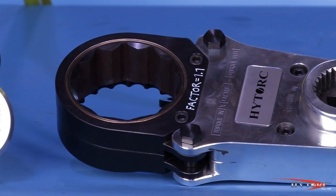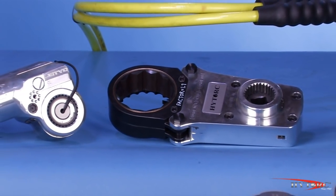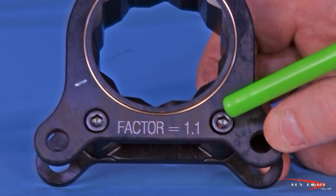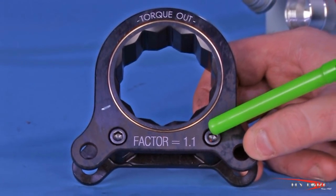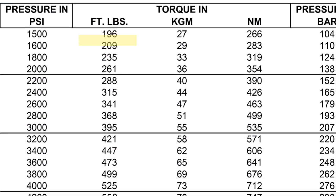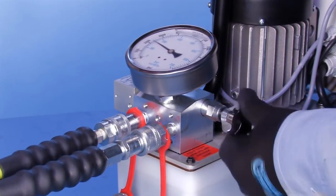Choosing an offset link with a 3/4-inch square drive receptacle and a 2-and-3/8-inch ratcheting link would be appropriate because 600 foot-pounds is well within the capability of the 3/4-inch drive ICE 1. Assume that the adjustment factor printed on the 2-and-3/8-inch ratcheting insert is 1.1. Following the formula engraved on the side plate of the offset link — desired torque times factor equals input torque — we would multiply 600 by 1.1 to get the input torque value of 660 for our torque-to-pressure conversion. Reading down the torque column for the ICE 1, we find that the pressure corresponding to 660 foot-pounds is 5,000 psi. This is the value we will set on the pump.